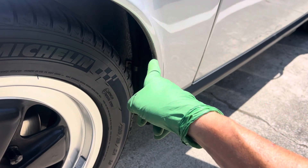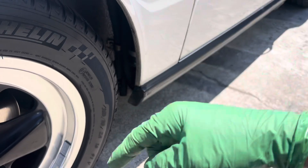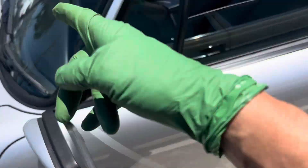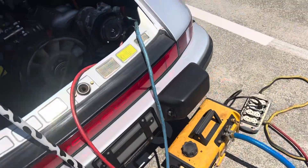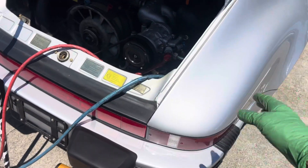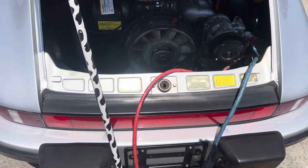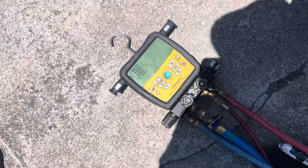Maybe I could get my camera in there and see if there's a little ball that floats around and moves when there's refrigerant flow. This has miles of refrigerant piping that goes all the way up and back. These old Porsches lose the refrigerant right through the old rubber hoses — no oil stains, no leaks, UV dye won't find it. It just migrates right through the hose. As they get older they become more porous, the rubber breaks down.